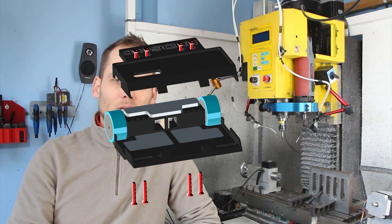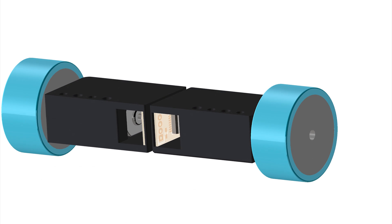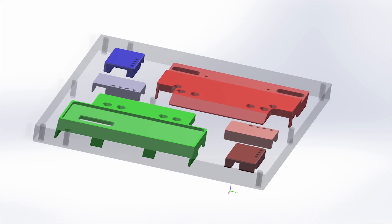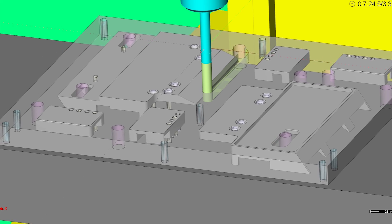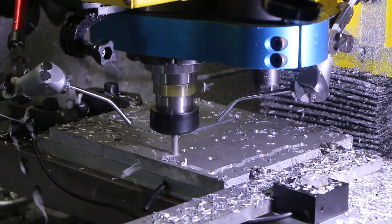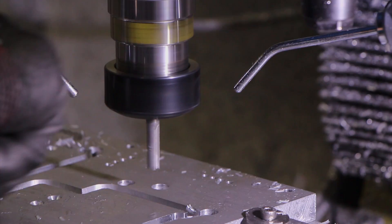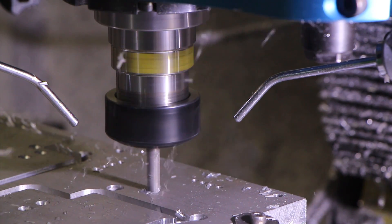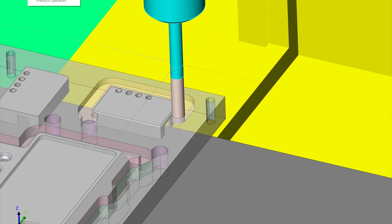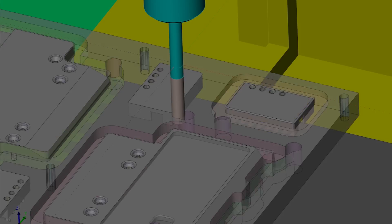The case was made from aluminium 6082 T6 and later it was anodized in black. The mass of the robot couldn't exceed half kilogram of weight. I decided to cut the whole robot in one go, from one plate.